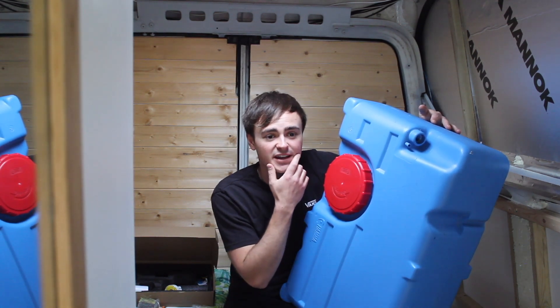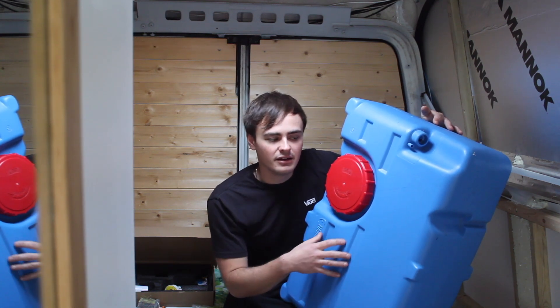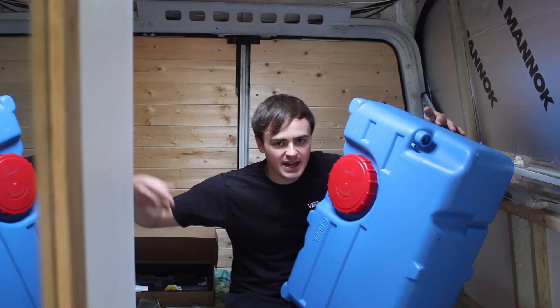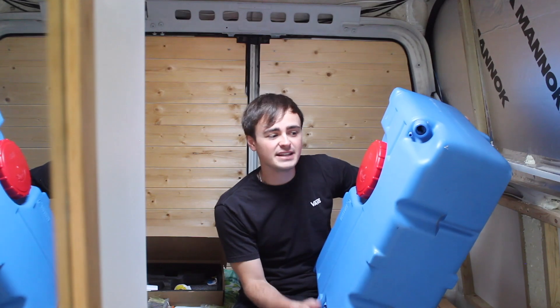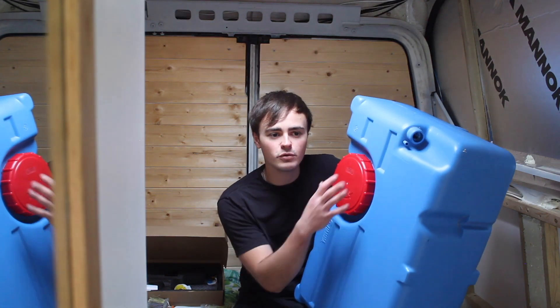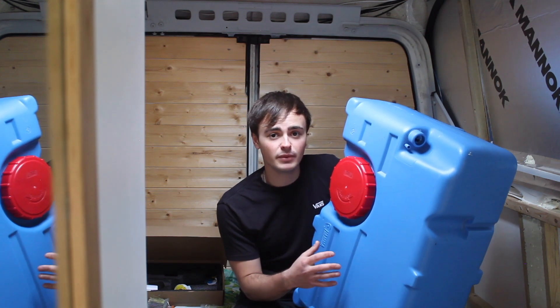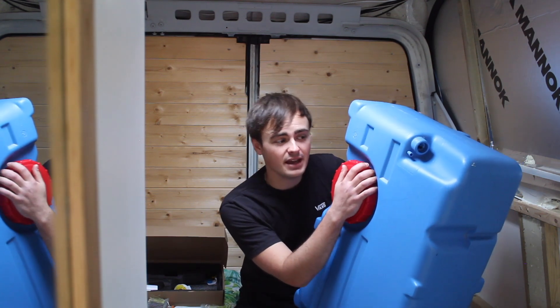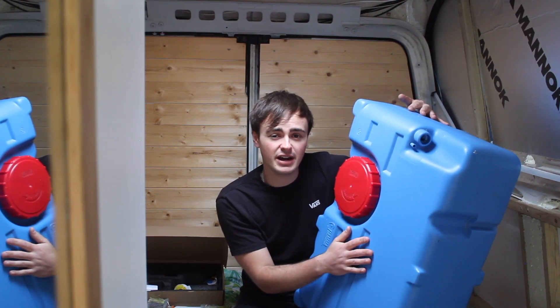I may not cover the vent installation in this video because I haven't ordered the hose yet, but you need to make sure you have a vent — when you're drawing water off the tank you need to replace that water with air, otherwise you'll end up collapsing the tank. I think 70 litres is a good size and it's a nice budget option. I'll put a link in the description below. I'm not sponsored by Fiamma at all — I just think it's a good product and wanted to share it.